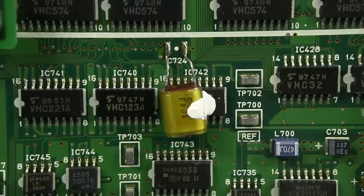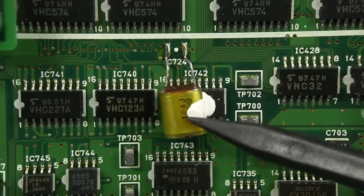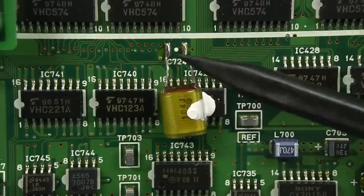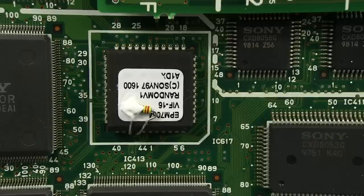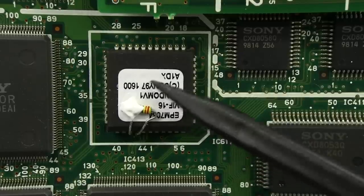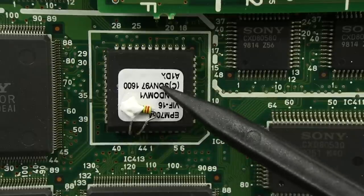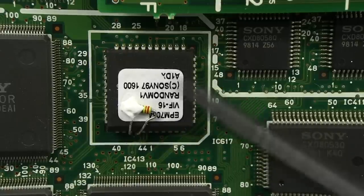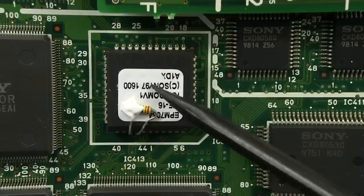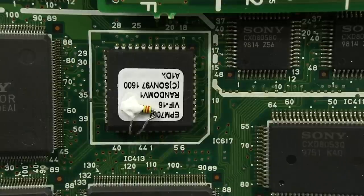And check this out, this board has 2 bodges on it. This is the first one. Look, they couldn't get that surface mount cap there, so they've put in a separate one like that, and they've gunked it down, radial cap in there. Why have they done that? I don't know. Even worse, looks like they've probably got some sort of pull-up mod here. They've got just a leaded resistor there on this Altera CPLD here. So yeah, likely something was giving them a pain, you know, they might have left a pin floating or something like that, giving them a pain in the ass, and they had to pull it up, perhaps.